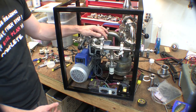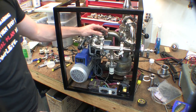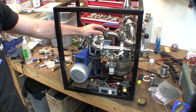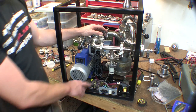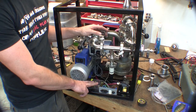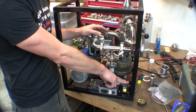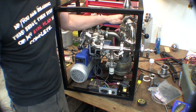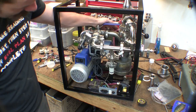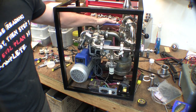The vacuum will probably rise a tiny bit inside it but nothing to worry about - it should stay within the fine range. I have a little 12 volt power supply down here which runs the pump, which is an old computer water cooling pump. This is the radiator - it's an old computer cooling radiator, and basically the whole cooling system is computer water cooling.